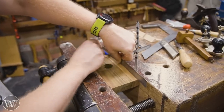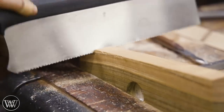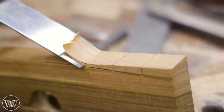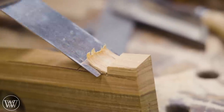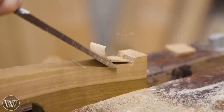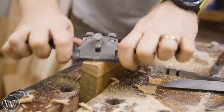Speaking of the main body, let's do some shaping on there. It calls for a curved arch in the front, and so to actually shape that off, we are going to cut down and then chisel back out. I thought about bringing in the compass plane for this, but it's an ever so slight curve, and I found it was actually just easier to hit it with the spokeshave and get it very close to where it should be. Popping off these chunks is always a very enjoyable process — it's fun and intriguing, and you can get very, very close with the chisel bevel down, just ride along getting close to that line. This is something I could do for a long time in the shop and still have a lot of fun, and that's the whole reason for the shop.